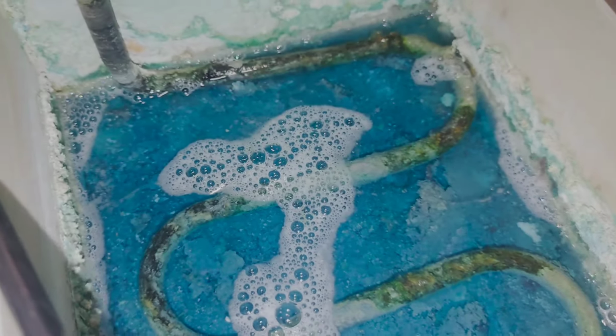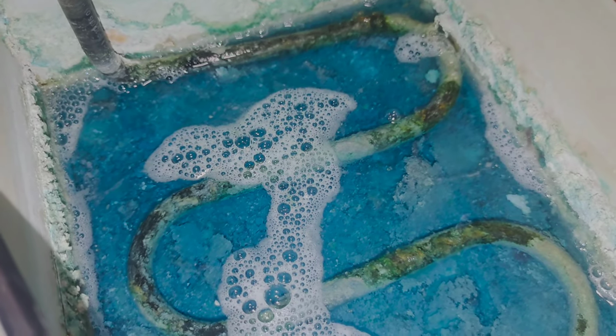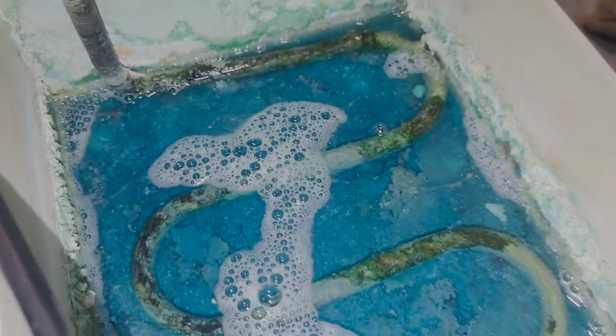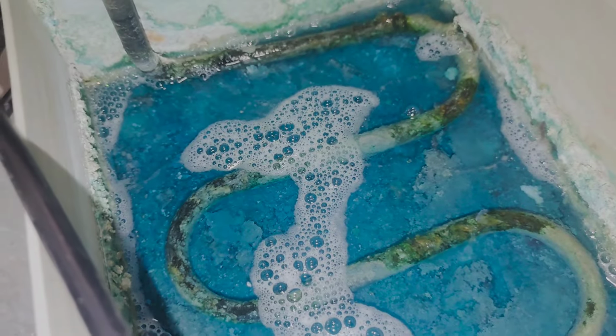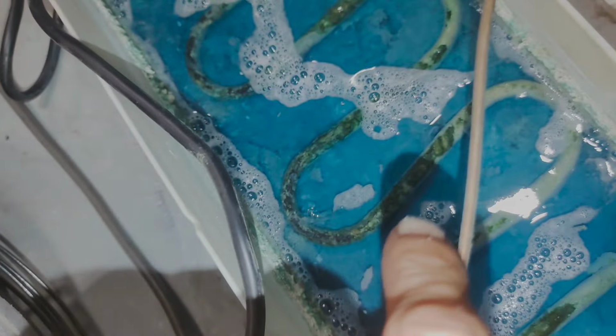Well, if there's not bubbles now, I promise you, based on the way it's flaking away, the layers are flaking off of the copper, it's just a matter of time before I do see some bubbles, or before we get some leaks. So they might as well order one of these and replace it before it goes out on them, and then we have to wait to order it, and then the unit's down. Because they don't like their units being down at this facility.